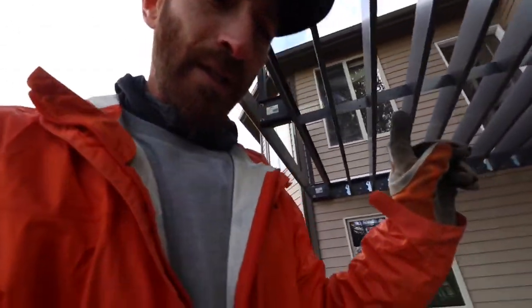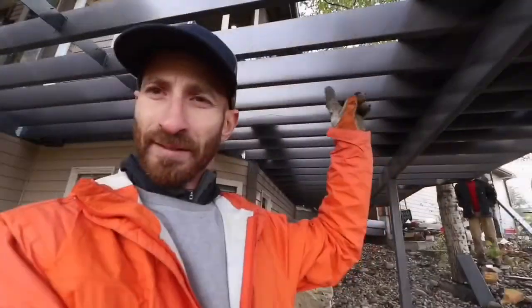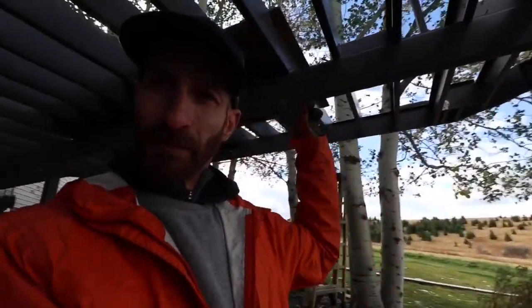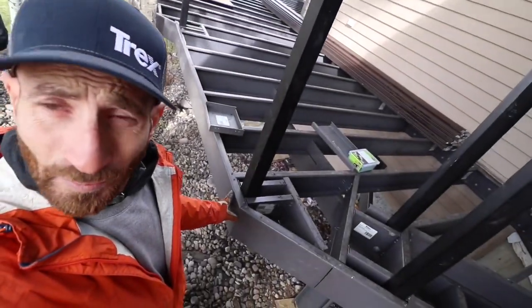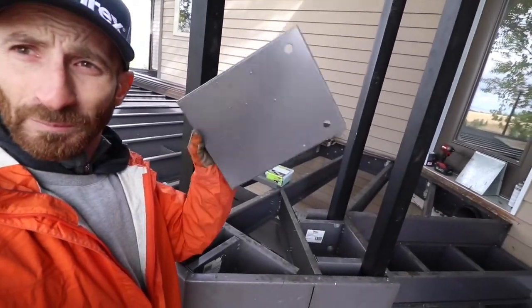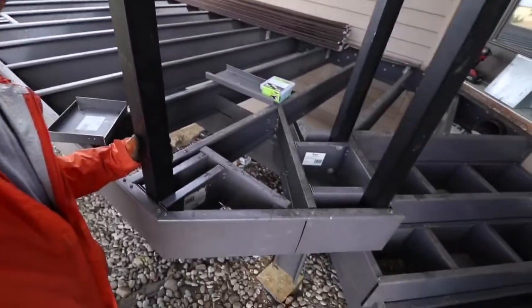We're almost done with our framing stage. We're doubling up on our beam so that we can have fewer footings. Our joists here are 12-inch on center with a 14-foot span from the house to the beam. That's why we're using 12-inch on center spacing, which increases to 16-inch on center for the area over here that has a shorter span. L-70 brackets at the house, mid-span blocking on every bay only in areas with a span more than 8 feet, and every other bay for the beam blocks on top of the beam. We mounted our railing posts — we're using the signature aluminum railing post which will be sleeved with a Trex Transcend post sleeve. We also use the Trex railing blocks, which are pre-punched and pre-made. It saves time, makes installation a lot quicker, and they're super strong.